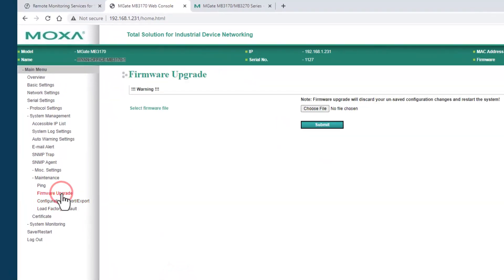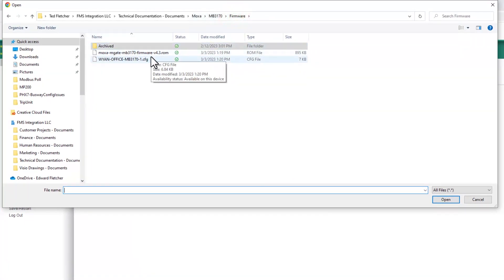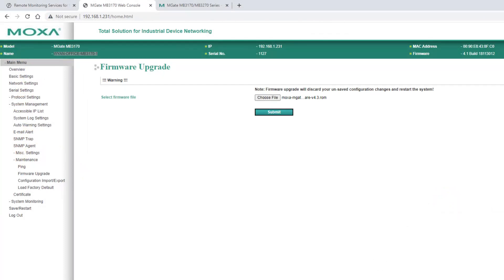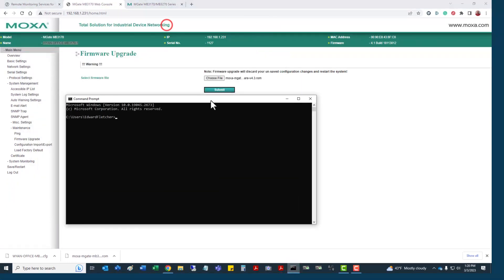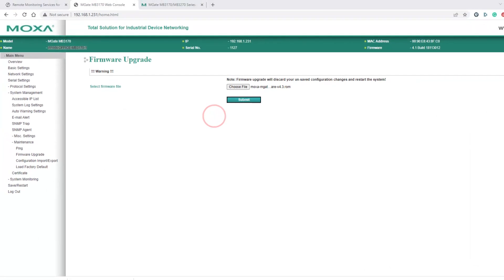Come back to Firmware Upgrade and left click on that, then click Choose File. Make sure you navigate to the right folder — there's the latest firmware file we just grabbed. Left click to select it and click Open. I also like to open up a ping — especially if the unit isn't nearby, since you'll hear it beep when it reboots. I'll set up a continuous ping to the unit's IP and drag it off to the side, then hit Submit.